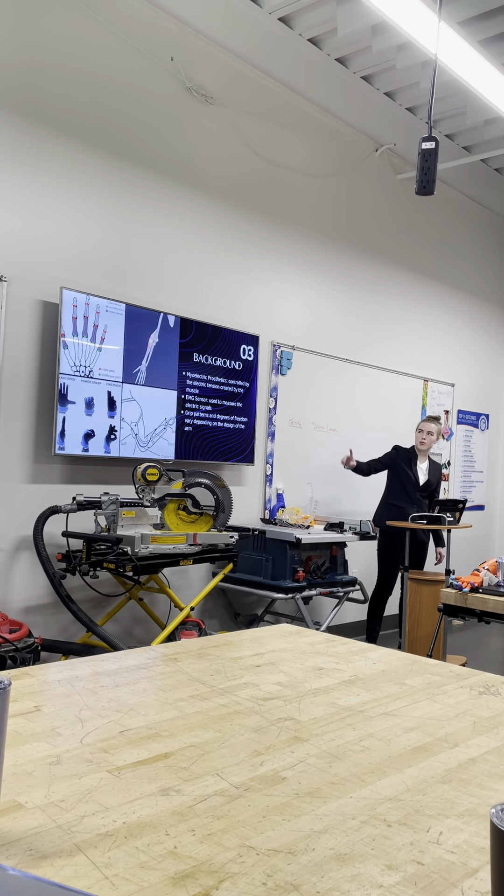For the code, lines 38 to 43 show the PWM, or pulse width modulation, for each finger, which determines the amount of voltage for each action. The range for an Arduino Nano is 0 to 255, which corresponds to 0 to 5 volts. I changed the maximum to 135 because the movement was too sudden and the motor attachments would come off. In lines 48 to 49, the minimum and maximum sensor values are set, which is 1 to 800. The original value was 0 to 1,024, but on average my arm reads at about 650, which meant the motors didn't detect much movement based on the values it was reading.